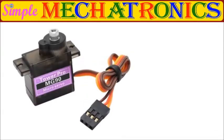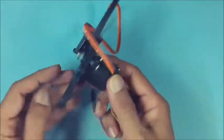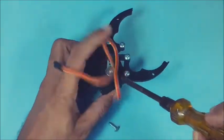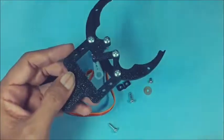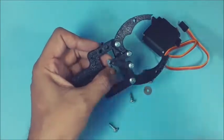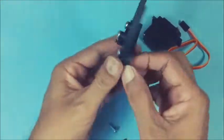We will now use MG90 servo motor for control. To use MG90 or any other small servo motor instead of MG995, open the 4 screws and the screw on the servo shaft. When replaced with a smaller servo, there is a gap all around the servo. Remove the turning link also, and plan to position the smaller servo motor.